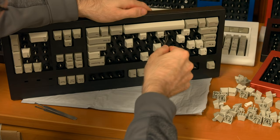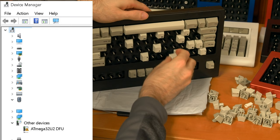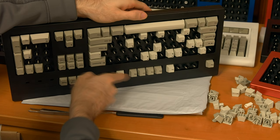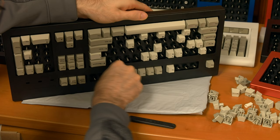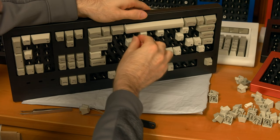If the keyboard is not detected, check that the USB cable is plugged in fully on the controller end as well. If you see ATmega32 in your device manager for Windows, system information for Mac, or hard info on Linux, you may have accidentally cleared the firmware and need to re-flash the firmware — see the advanced topics section to fix this. Also try on another port and on another computer. Test each key with the keyboard tester website. Refer to the product page for the factory default layout. For example, the right control key may be factory programmed as the function key, so when you press this key, it will not register as a control key and it will appear that the key is broken.